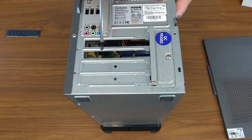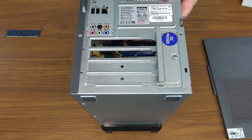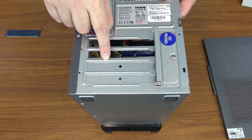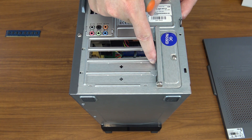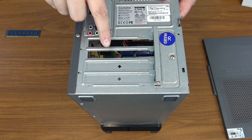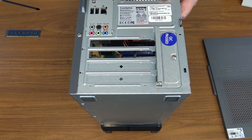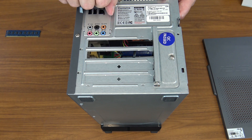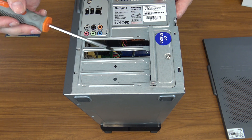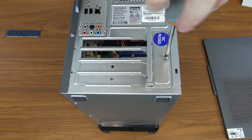You take your Phillips head screwdriver and you'll see it fits in there perfectly. You don't push in this way because all you'll do is bend the metal of your frame. Instead, you rock it back and forth because what you're trying to do is break those tabs. If you have a pair of needle nose pliers, you can take it from the top and actually bend them down that way. You're trying to wear out those three small connection points. When they snap, simply take it off and throw that piece of metal away — once they're gone, they never go back. Once the top two slots are open, the other thing you need to do is undo this one screw.